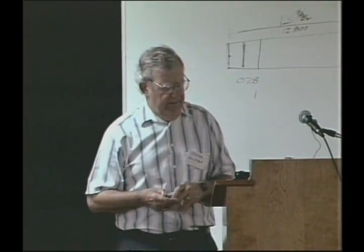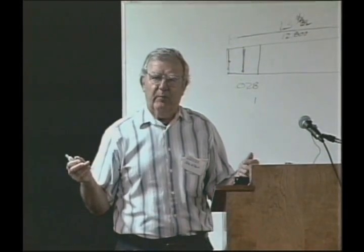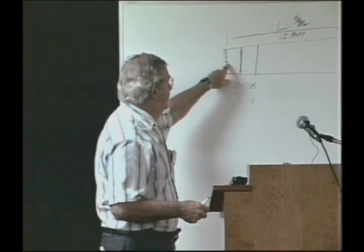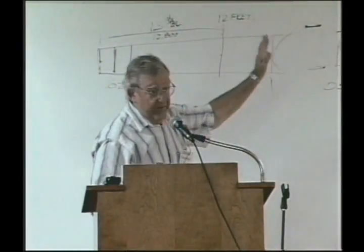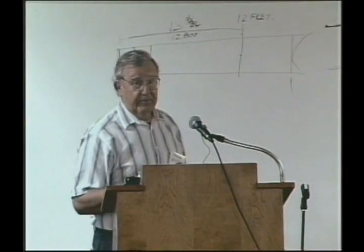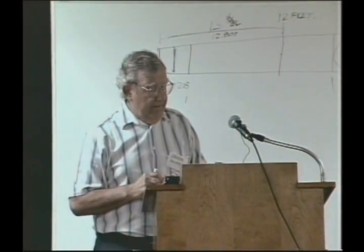So I took the guitar and I did a few things on it. I said, boy, it sounds bad. I put the scales on it. I said, oh my God, there's no setback on the saddle whatsoever. So what I did is I took 35 thousandths off the back of his fingerboard, which made it something like a Gilbert guitar, and was able to milk enough out of the saddle that I got my 50 thousandths and the guitar played in tune. So he came to pick it up, and I'd gone over his frets and stuff, but he picked it up and he played it.